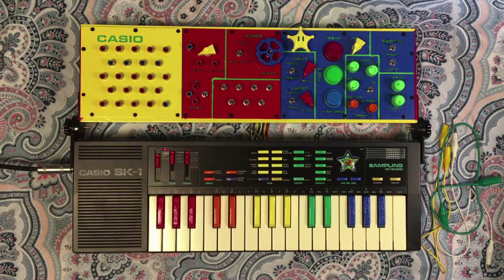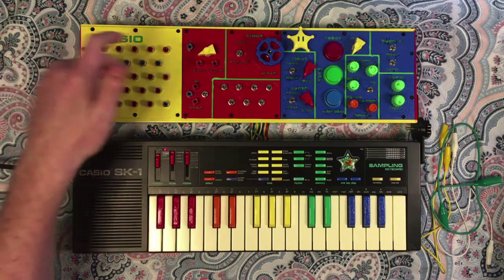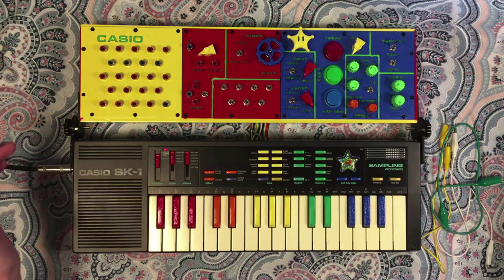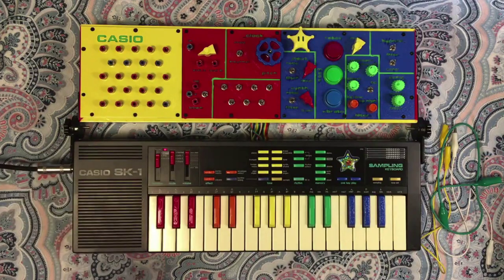The next thing are these blue jacks, and those indicate points that have different functions or might be a little less stable. Working across here, this first one is a ground connection. That way if you want to, you can connect a data point or one of the other points and pull it down to ground, essentially canceling that signal out instead of mixing it with something else.